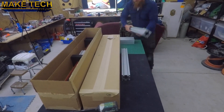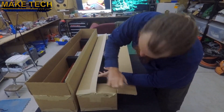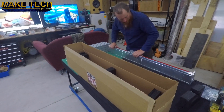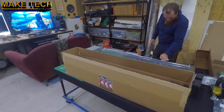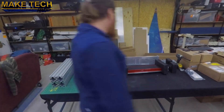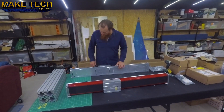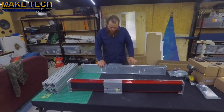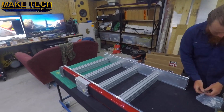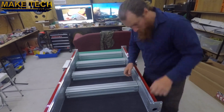I'm just starting with the two Y-axes and joining them to the four cross members. They're 1.3 metres long and provide 935 millimetres of travel. Avid CNC have developed a nice fixture method for the extrusions making it quite quick and easy to assemble the unit.